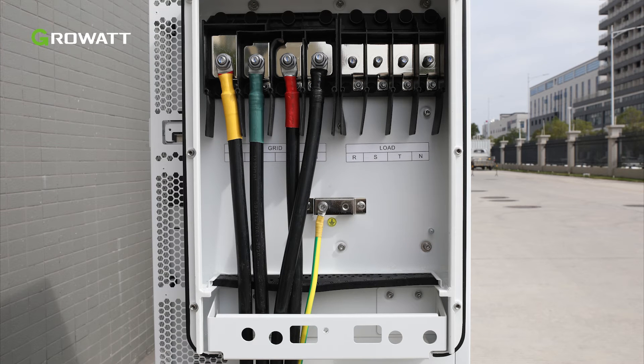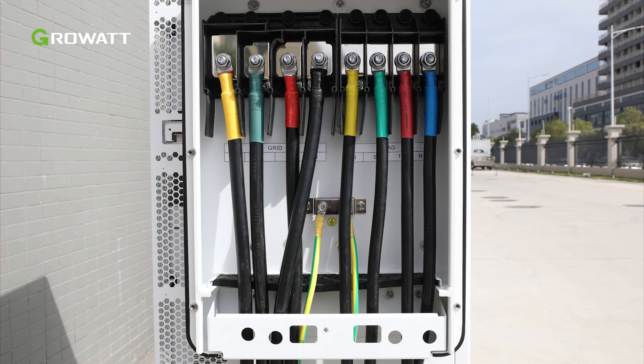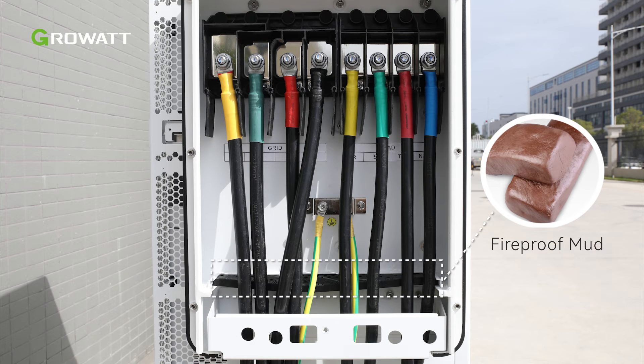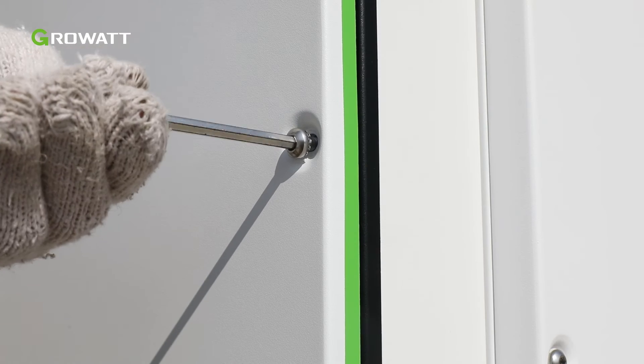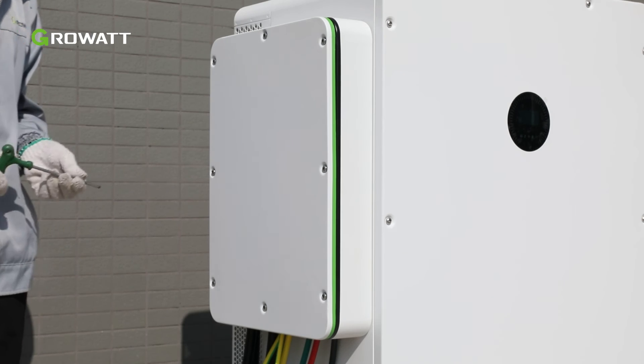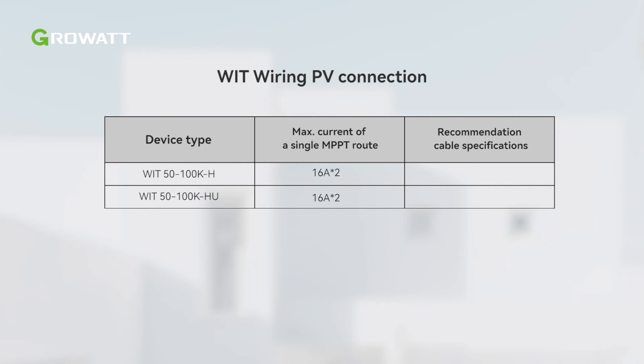For HU or AU models, there is a set of load ports in the AC junction box. Connect another ground cable to the copper grounding bar, then connect the cables to the load ports. After connecting all the cables on the AC side including main panels, apply fireproof mud to the waterproof silicone mat at the inlet side. Connect the ground of the box panel, then lock the cover of the AC junction box. The rated AC power cable specifications are illustrated in the table — please choose the appropriate cable according to the inverter model.